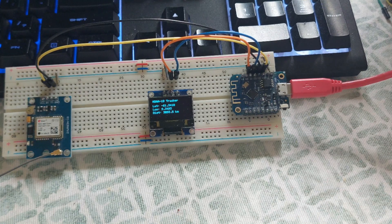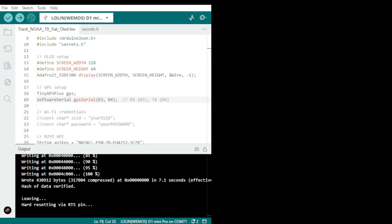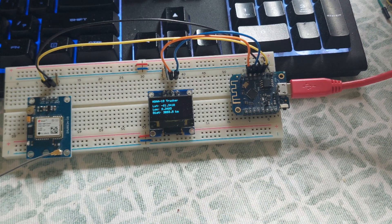With my super piece of wire on the windowsill it seems to work — the flash light is on and off. So it's very important: I'll add the tester file as well. When you put everything together, test your pins on the GPS first, always swap them at the end, and then test again. If you don't swap them you'll have a blank serial monitor with no GPS output. Okay guys, thank you very much, have a good day, ciao.